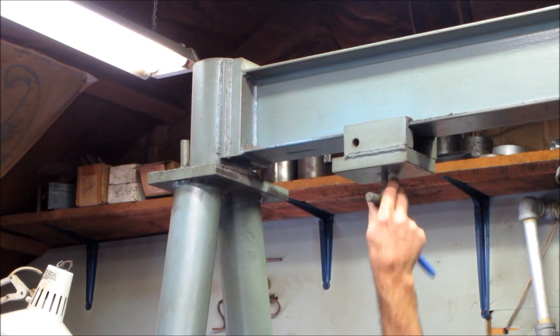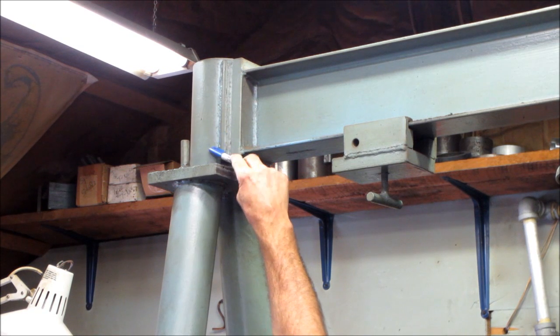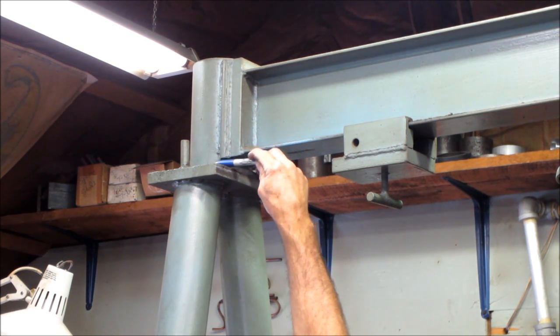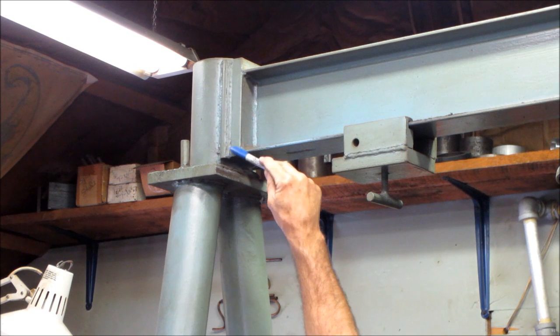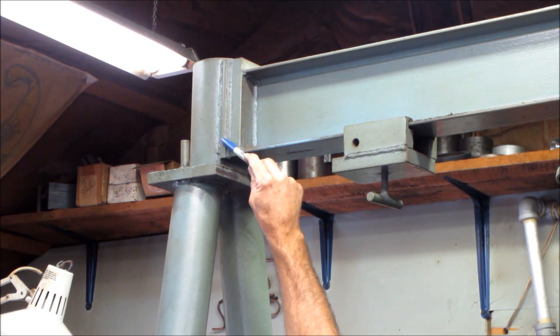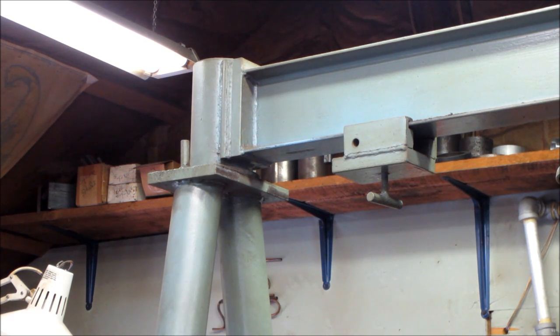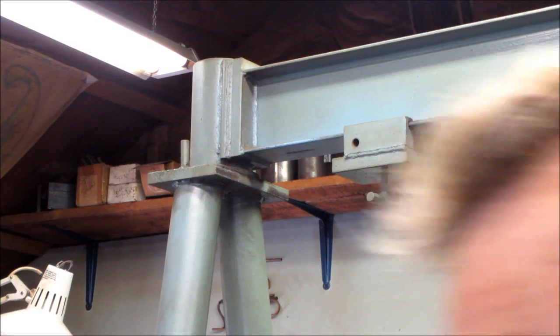This is just one pipe over another pipe. I machined the flange while the bed is in there, and this is just a plate butted here with a piece of round stock and a couple welds to secure that upright on the end of the beam. Now let's go ahead and pick up the face plate.